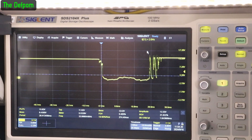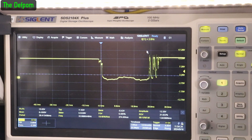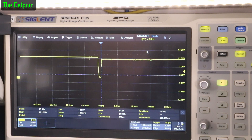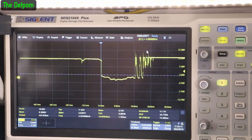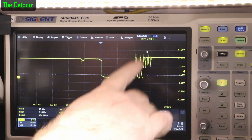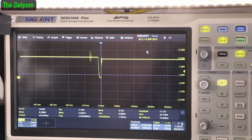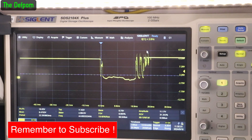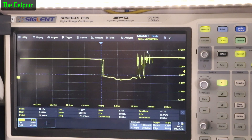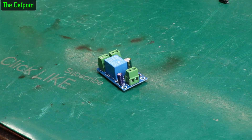Let's try changing it again — I'll change it to 10 microfarad. Let me hook up the scope. Power on. We'll do a switching test. Turn it off — that's the turning on time, so that's normal: 2 milliseconds as before. So at 10 microfarad we're getting down a bit further. It's like 20 milliseconds, but with a lot more contact bounce. So going from 33 microfarad to 10 microfarad — which is a third of the capacitance — we're not getting as much of a gain. We're getting a gain still, but it's not as much. And here you can actually see ringing in the power supply. So I think I've gone too low there. I think I'll go back to 33 microfarad and leave it there, because that looks like it's going to be a bit cleaner. Well, there you go — all done. It works. Easy enough.